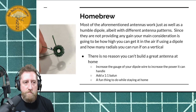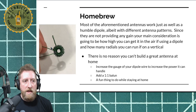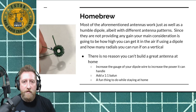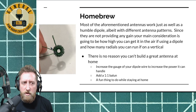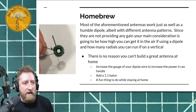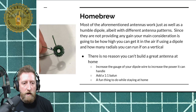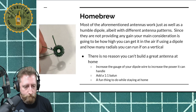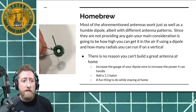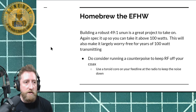I must repeat — I am mentioning antennas that can be purchased online, but you can do most of this via homebrew. Plans are everywhere, not just blog posts but YouTube videos with examples. If you're thinking about going down this road, see how expensive it would be to do it on your own — it's not that hard at all. The easiest thing you can do is just cut a dipole for a band and get out there. If you want something more robust, increase the gauge of the wire, attend to the tuning appropriately, and add a 1-to-1 balun. Look up the projects and have fun — this is a great thing to do while we're dealing with COVID-19.